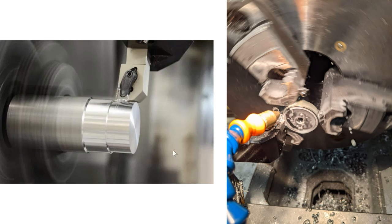Here are some pictures I found. On the left you can see someone reducing the diameter of a part as the machine spins and the tool moves to the left. On the right is actually a part I was making on the lathe in the shop — you can see the tool to the left progressing inward towards the center of rotation, taking out material as it goes. This was cutting titanium, which is very hard to cut, and that's why you can see the little carbide insert. This is a situation where you want to use carbide over high speed steel.